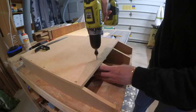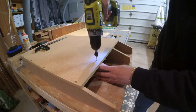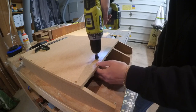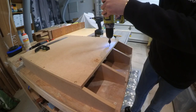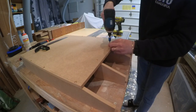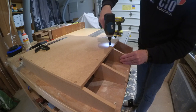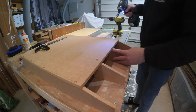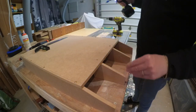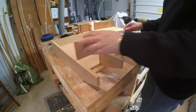Now that it's turned around, I think you can see what I'm trying to go with this. Everything is generally always pre-drilled. This is MDF, remember — so if you just put in a screw that goes into the vertical parts, you will most probably split the wood. This is 12mm MDF. You just really need to be careful, so always pre-drill and then drive the screw in. In this case, everything is always glued first, and then followed up with screws.